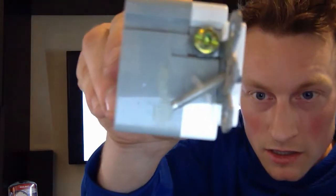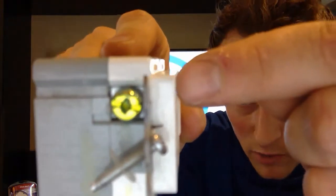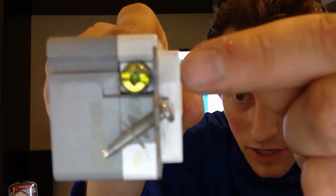Getting into other questions we said we'd address: how do I install a GFI? How do I install a ground fault circuit interrupter? Well, if you have an existing circuit, you're going to want to verify your wiring is grounded. If it's not grounded, a ground fault circuit interrupter can still help you. Your ground wire is going to go clockwise around your ground screw. Some models make it easy — you can see the line for the bare copper wire, and it wraps clockwise around the screw.